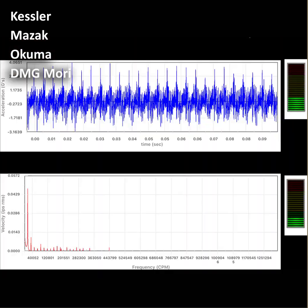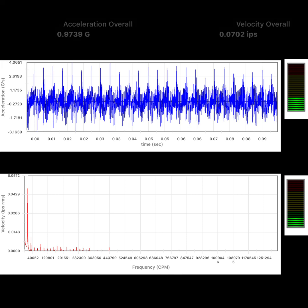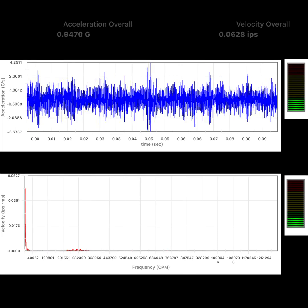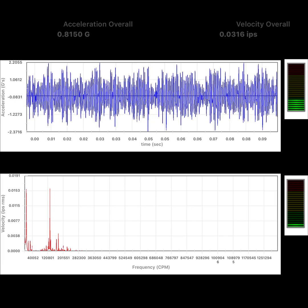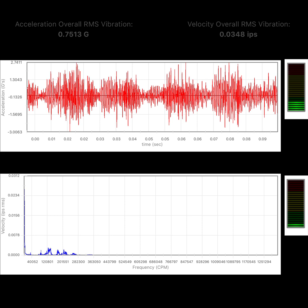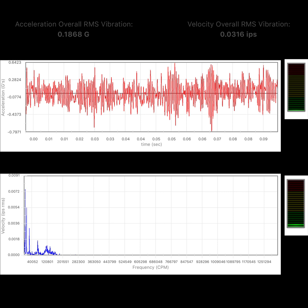At Motor City Spindle Repair, we digitally record all the spindles we run in-house for your review. We also take vibration analysis signatures of your spindles, and we record this documentation in acceleration and velocity. Acceleration and velocity tells us the overall health of the spindle bearings, preload, and balance. This guarantees the highest quality control and that your spindles were rebuilt correctly.